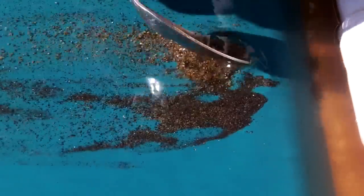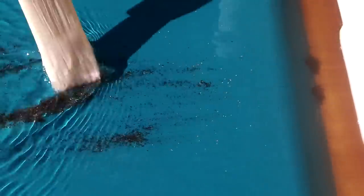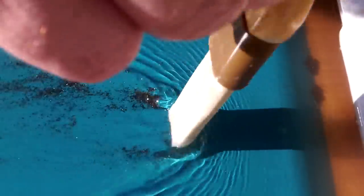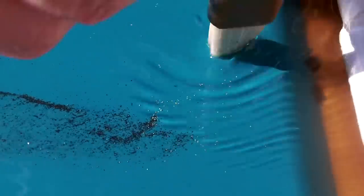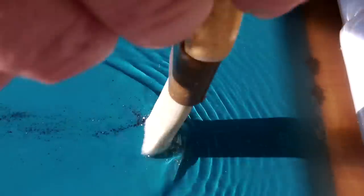If we determine that there is gold in the sample, we'll go to more steps and screen the material all the way down to minus 100 mesh and run it across the table, then extract all the big gold and the fine gold out of it. As you can see here, this is a run of some of the finer material that's been screened down to 50 mesh - the bigger stuff is about 50 mesh and the smaller stuff is down into the 100s or maybe minus 100s. You can get an idea of how well this does with both fine gold and large gold - I've been real happy with it because it picks up pretty much everything I see.